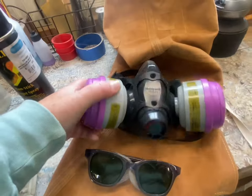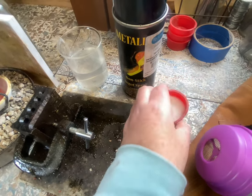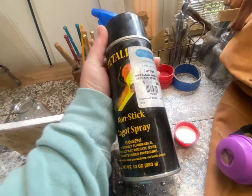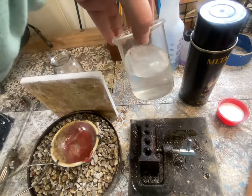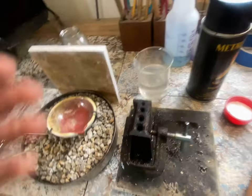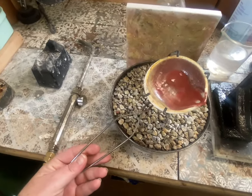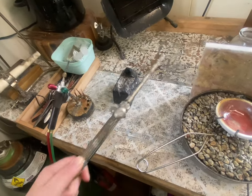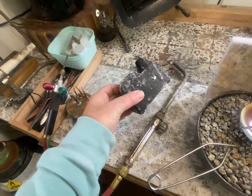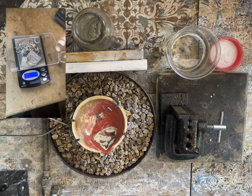You need safety glasses, a respirator, and a leather apron. There's borax, which I'll go into detail about later. We have nonstick ingot spray, a cup of water to quench the silver, an ingot mold, and a soldering board that I leave out to help with the heat. This is a crucible that has been seasoned — I'll have a later video about that — and an acetylene torch along with my igniter. All these items are listed in a link below.